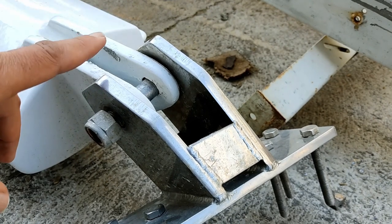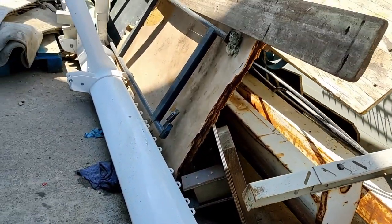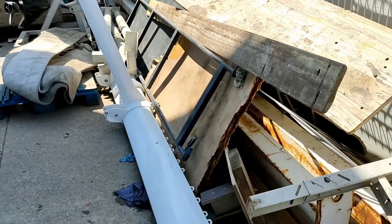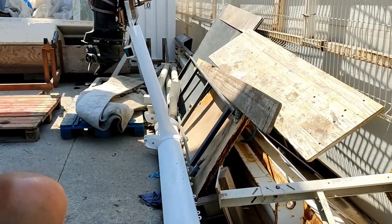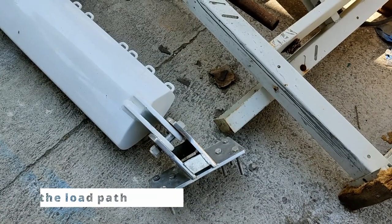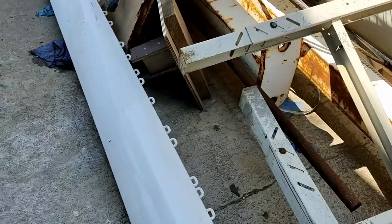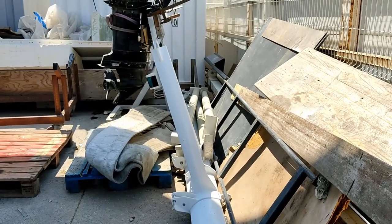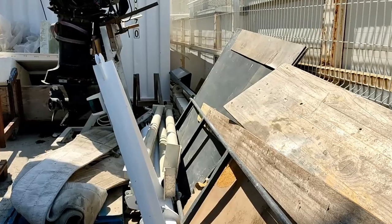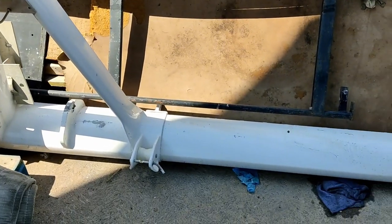The martingale wire went from here up to the top of the seagull striker. You can see at the top of the seagull striker there's a great big 12-millimeter wire that went from down here up there and made this connection. What we have to look at is the load path — how the load goes from the forestay and gets connected to the boat. It's through those connections where the biggest differences lie between the old beam arrangement, with all its mechanical nuts, bolts, pins and hinges, and the new carbon beam arrangement where everything is glued and bonded and basically becomes homogenous with the boat.